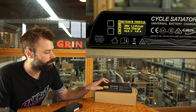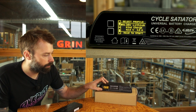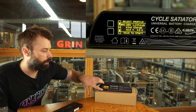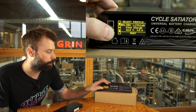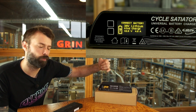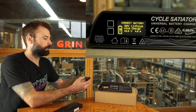I'm going to press and hold to select this charge profile. It says 'do you want to activate this profile?' — I'm going to say yes. From there it goes into the charge select profile screen. Because this is the first time I'm setting the device up, I have to tell it to start, so I press and hold. It says 'connect battery' and tells me what profile is active: 36 volt lithium, standard charge, 42 volts final charge voltage, 4 amps charge rate.